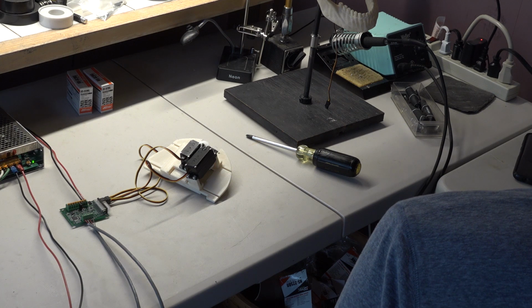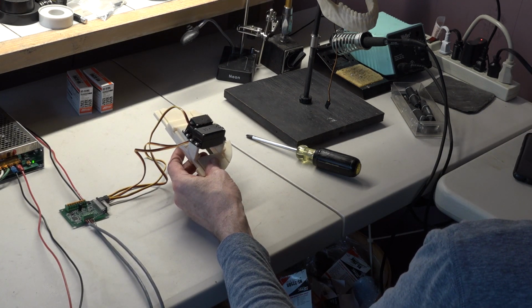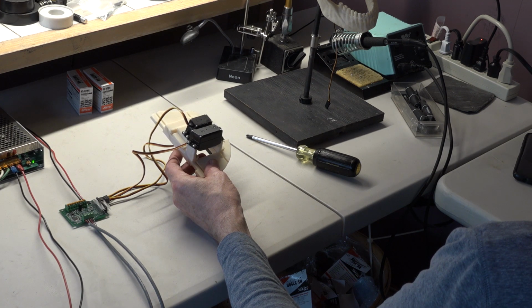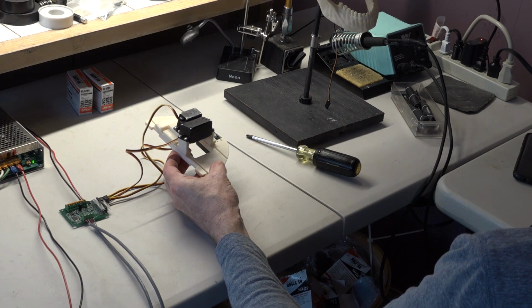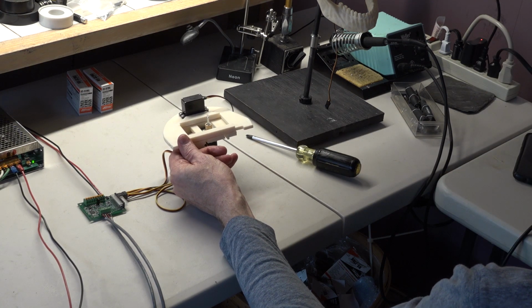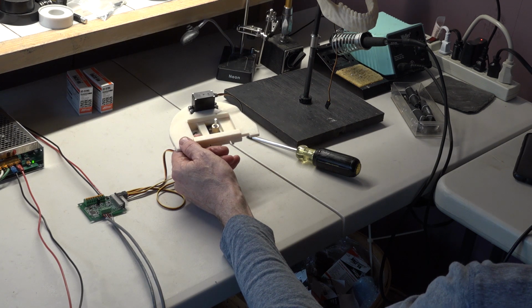They turn off. I'll move the nod servo. So you can see what that's doing is moving back and forth this servo, which causes the middle servo to move forward and backwards against the skull. Okay, now I'm going to move the tilt servo, which is the one in the back. And that slides this back and forth. It's going to make the skull tilt. Slow or fast. All right, and then I'll turn, if you can see it move. You should see this rod spin when I do the rotate servo. So everything's working fine, and it's ready to reset the positions to center. There we go.